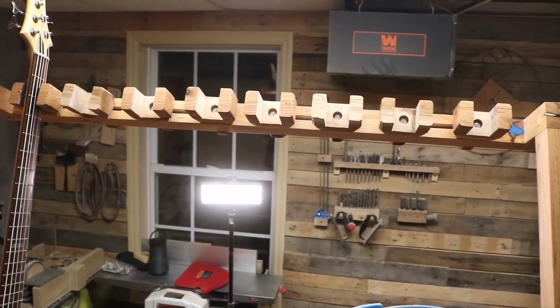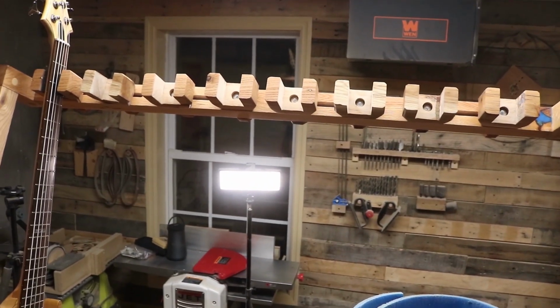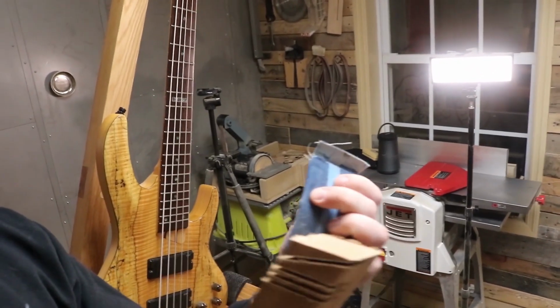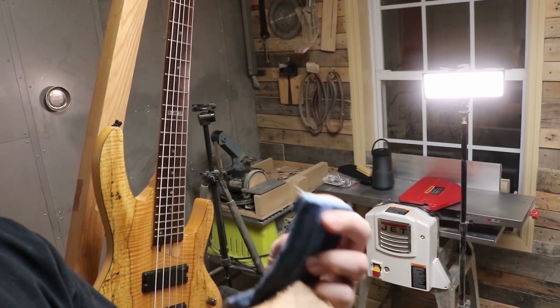So what I'm going to do is cut out the foam. I'm going to do the bottom stretchers first. Once I do the bottom stretchers, then I'm going to start tackling these. The plan is to attach the fabric to the padding with spray glue. Now I've done a test and it does remarkably well. The spray glue sticks really well to this foam padding. It actually kind of melts the padding a little bit. So it definitely sticks really, really well.